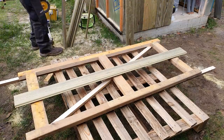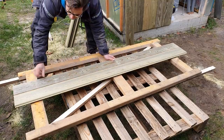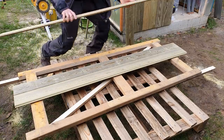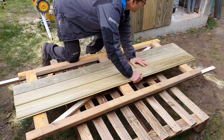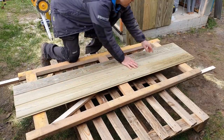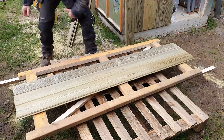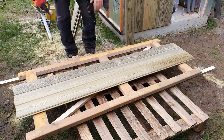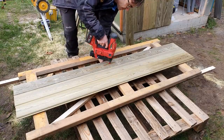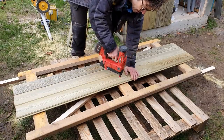Now we just keep cladding that either side. What I like to do is put a board either side, so I'm fixing a pair. You could put them all across, but the only trouble with that is you want to see where your fixings are, sort of here, here, and this is just a nicer way of doing it. Otherwise, you're guessing. And you can push up any bow or bend.